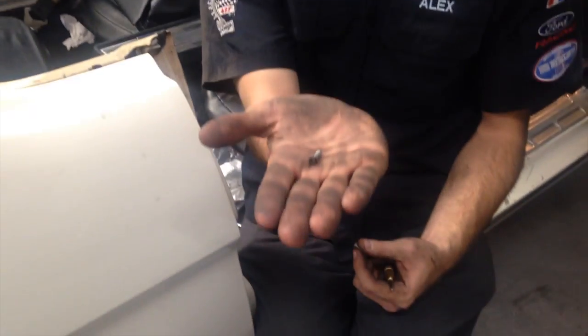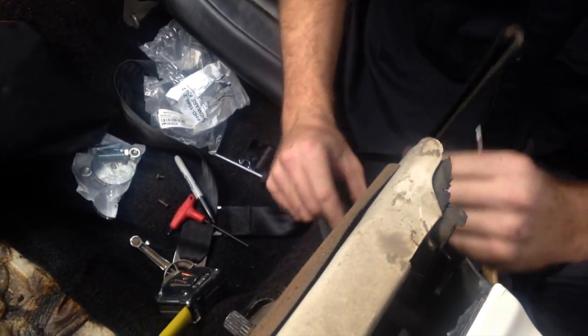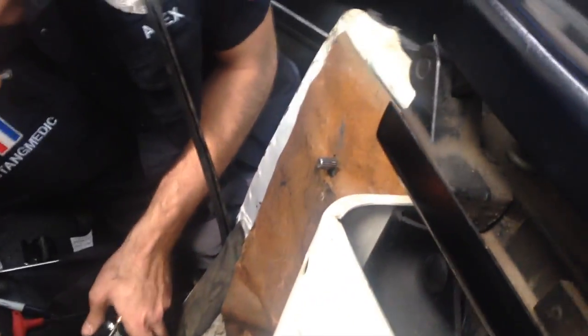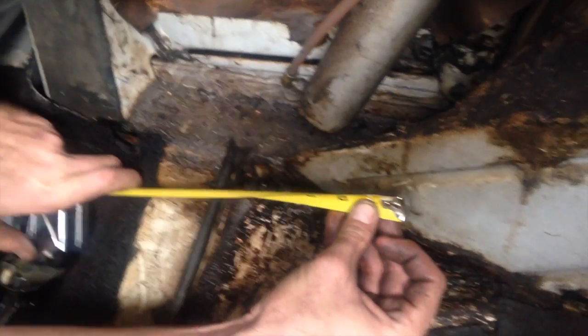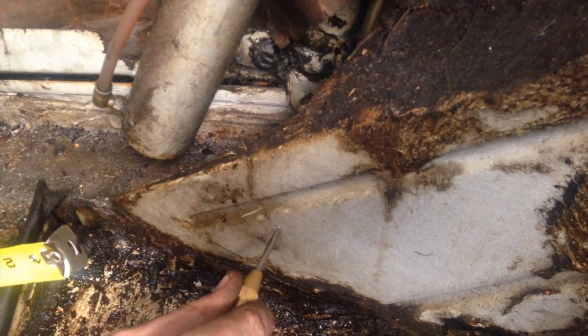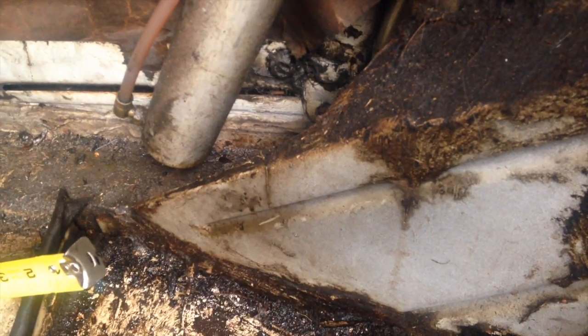Make the hole, get it mounted, put the back seat in, and your seat belts will be installed and your car will be that much safer for your back seat occupants. The corner panel's off - it's held in by just two screws: this one which goes below the window crank, and this stubby one that goes right here. Just two screws, and you gotta peel back the wind lace here, and then it should pop right out, which it did. Now I've measured - it's at a slight angle, but I was able to eye it quite well. It's six and a half inches from this seam up here, so I already marked the hole there. Take the spring-loaded punch and make sure you mark a good hole through this thing. Now you have a small pilot so you can drill the hole and not have the drill walk all over the panel.